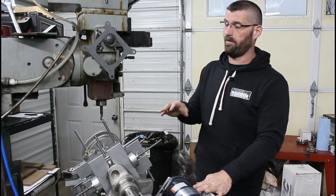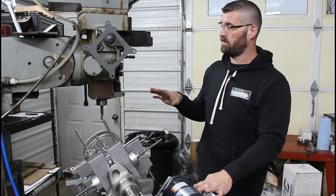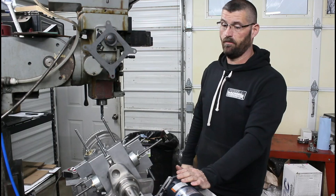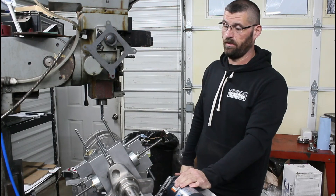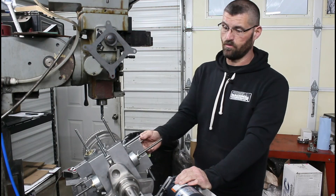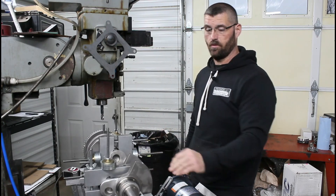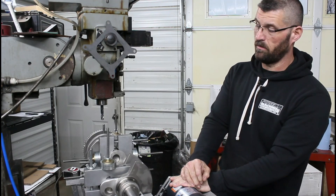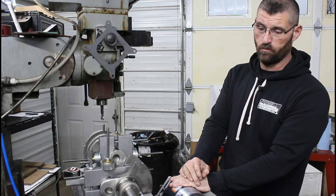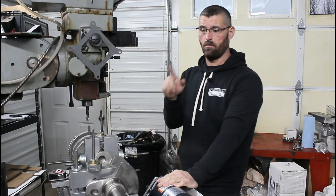Unless you've got to do Mallory, it's pretty straightforward. The Turner Mill Mount Balancer is just awesome — it is light years ahead of what we were doing, so I love it. Most stuff is well under an hour to balance if everything goes well. That first crank, I don't know, I hadn't had one do like that, and I sure wasn't going to put Mallory in something that didn't need it. We will do some Mallory and I'll show you that process — it's just time consuming. Alright, there's another video, like, share, subscribe. Thank you so much for watching.